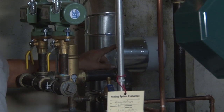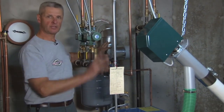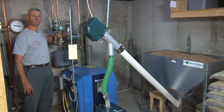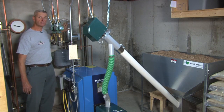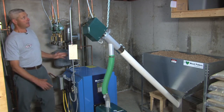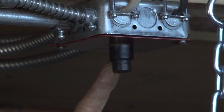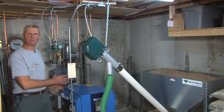There's not much change to this boiler — we still have all the same basic parts. The flue pipe and all the electrics are pretty much the same safeties you'd find with oil. One important difference is that you need a lined chimney. This flue pipe goes into a lined chimney, so you need to have one or factor in replacing your chimney. All the electrics remain the same: you have a thermocouple and a thermal switch above the burner that will shut it off if it gets too hot, just like with oil.